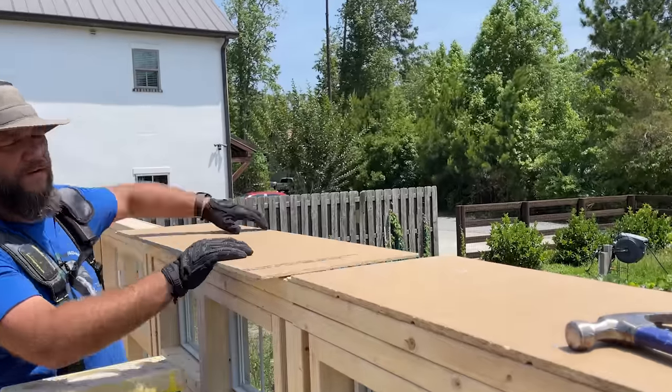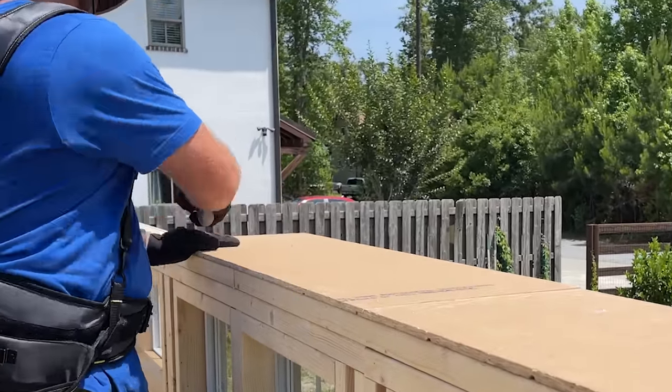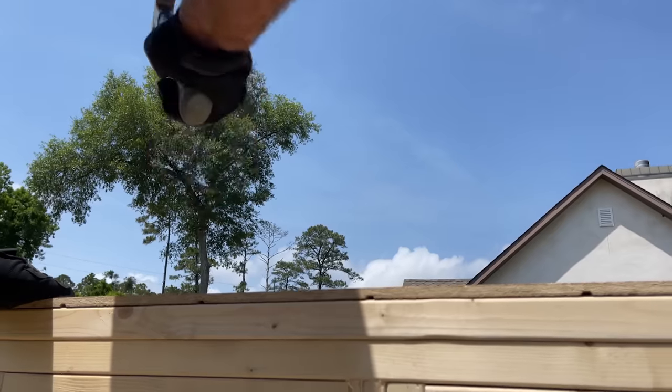With the top plates installed, it was onto the soffit boards. These are super easy to put in as well. They have a lip on each side that makes them easy to line up, and I just attached them using the 2-inch nails provided with the kit.